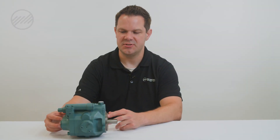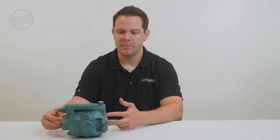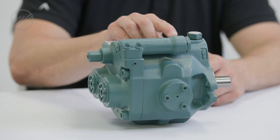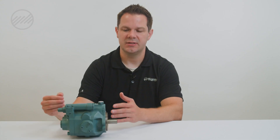If you've gone through the full setup procedure and you've turned your motor on and you're still having trouble getting your pump to prime, a couple things to check. Number one, make sure that your oil level is sufficient in the tank. Number two, potentially you have a suction strainer or some sort of problem with flow into the pump — so you may want to check that as well. Ultimately, if you have the pump filled with oil, your case drain port connected to the tank — possibly through a heat exchanger — and you have good flow on the suction side, you should be able to get this pump to build pressure.